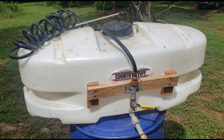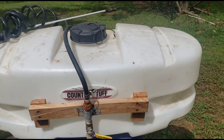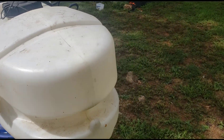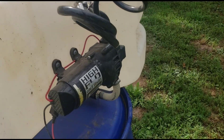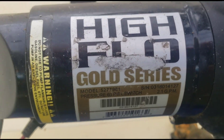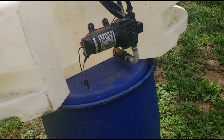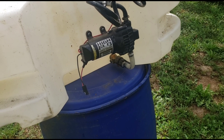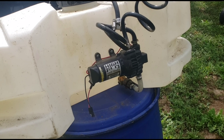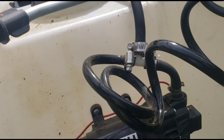I'm going to show y'all what it is and how I did it. It was a 30-gallon Country Tough sprayer that was on sale for $150 at Orscheln's. I noticed it had a larger pump on it — 2.1 gallons per minute. Most of them, I believe, are 1.5 gallons per minute. I knew that larger pump would let me use it as a boomless sprayer. You could probably use the smaller ones, but they just won't have as big a swath. This does about 25 to 30 feet.